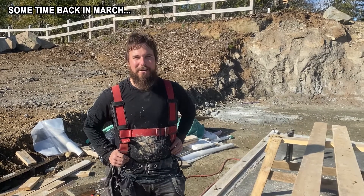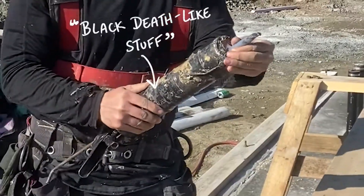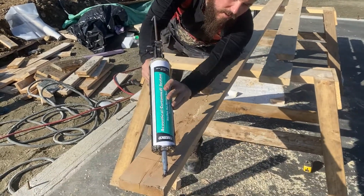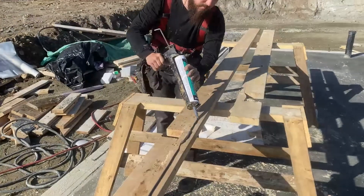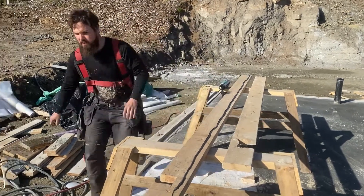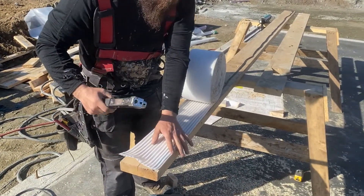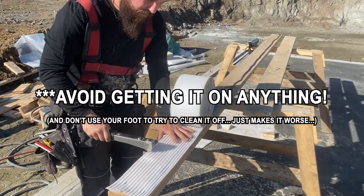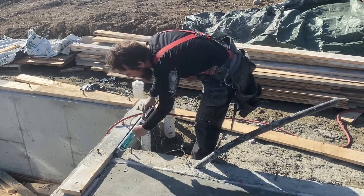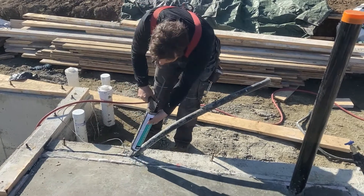So today we're down at Roberta Ranch and we're getting our plates down. A way that we're going to try and do our air sealing on these plates is we're going to use something called acoustic sealant, which is this black death-like stuff here. We put that on the inside of the plate. It gets stuck to absolutely everything, which is quite annoying. On the plate we're going to put some acoustic sealant where the two joints butt together and then bring it along the bottom, making sure that we're sealing the air from inside to outside.